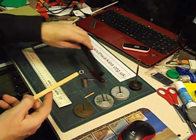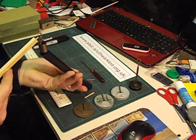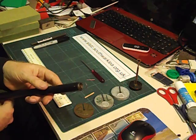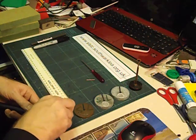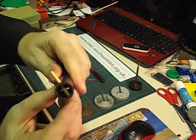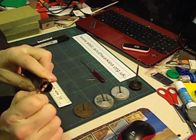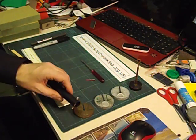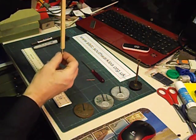We now thread the spring through — we've got the hole at this end and we pass it up the plastic pipe until it pokes out the other end. Then move it back a little bit so that we can put the piece of 4mm dowel through the holes and through the loop. It's going through the loop, and hopefully it's a nice fit — that feels really tight without glue. If you can't push it through, you could just tap it through with a hammer. We've now got our force meter assembled.